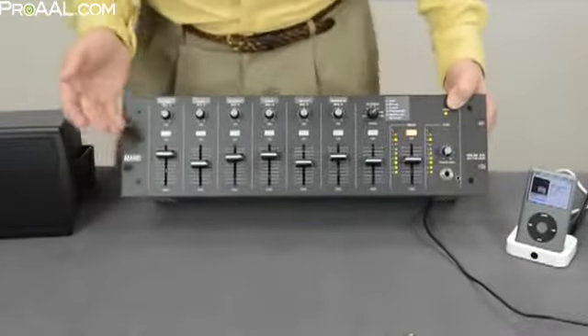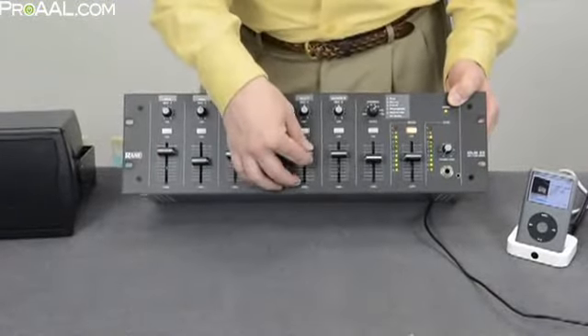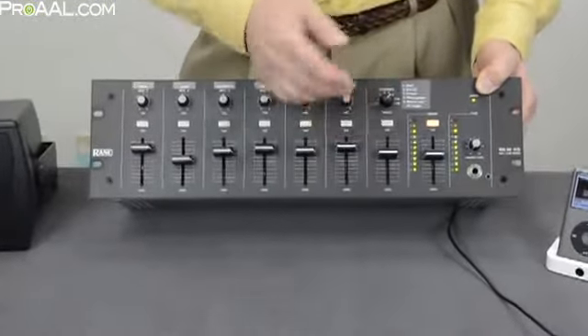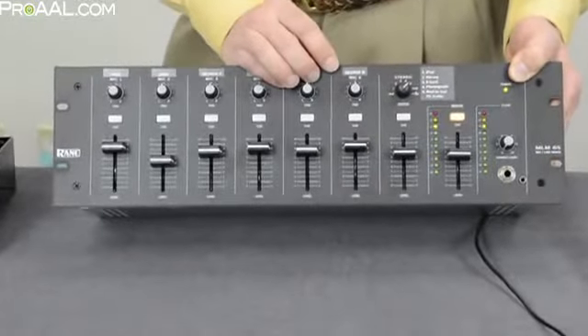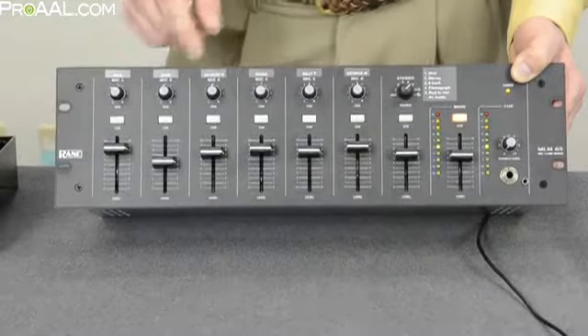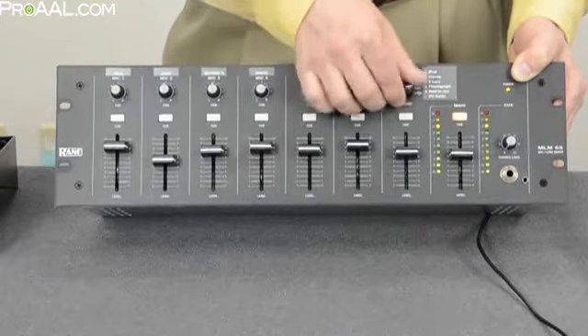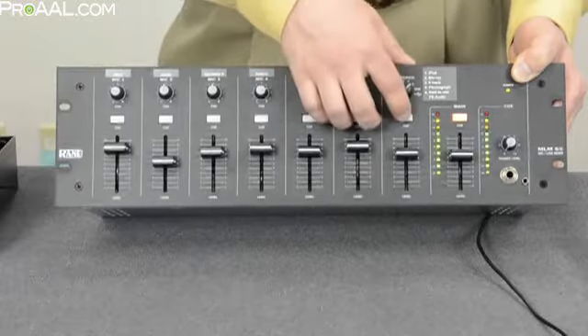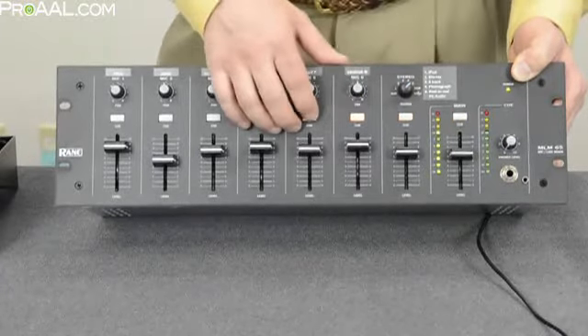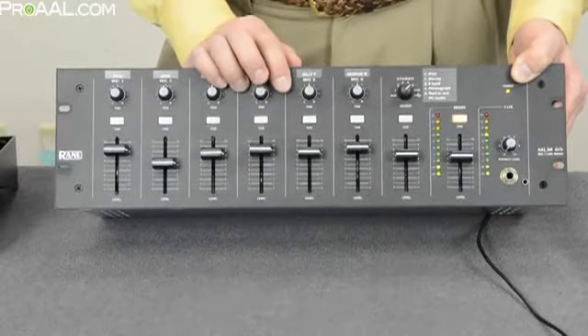The mixer interface is very simple and intended for non-audio professionals. Manual front panel sliders mix sources and visually indicate levels to end users. Easily printed labels show users the available mix sources, and a single source selector reduces confusion, permitting only one music source to be heard at a time. Cue buttons across the front allow headphone monitoring of individual inputs or the main mix before bringing up the sliders into your loudspeakers.